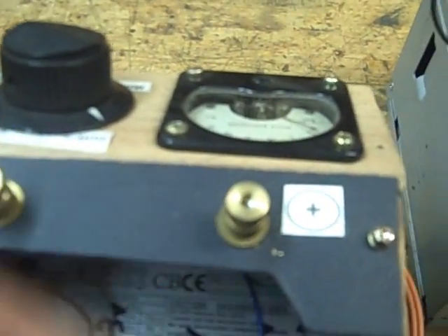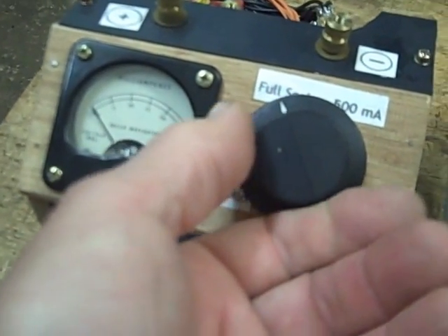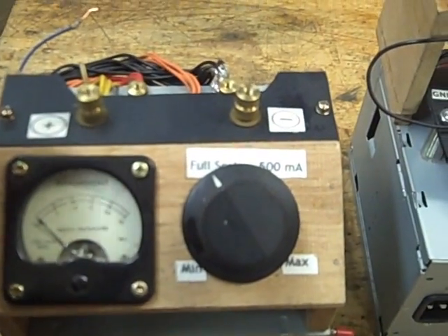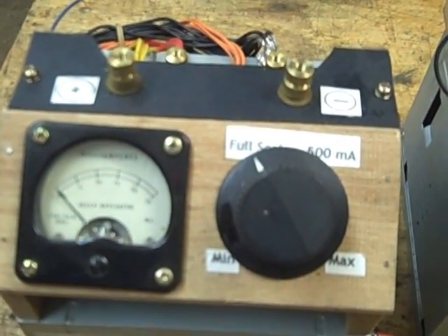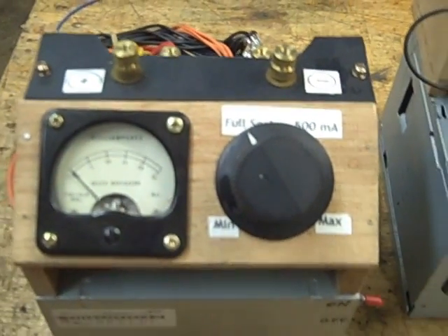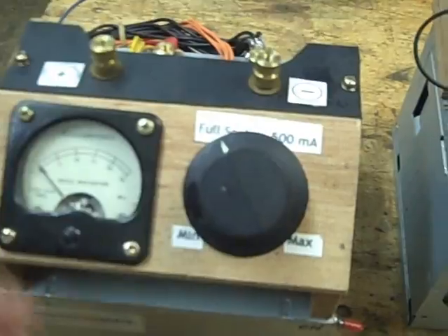You can see I can join it to any one of the three different voltages, and then I get the negative and the positive coming out here. I attach whatever I want to work with here, and with this control I can govern the amount of current. I'm still getting that 3 volts or 12 volts or whatever, but then I can figure out how much current I'm actually putting through whatever it is that I'm doing.